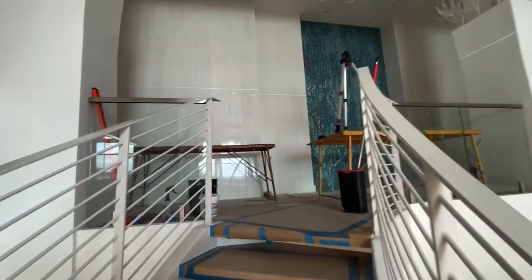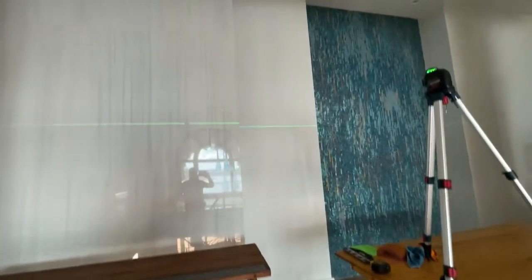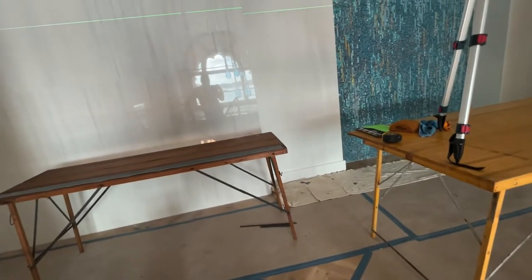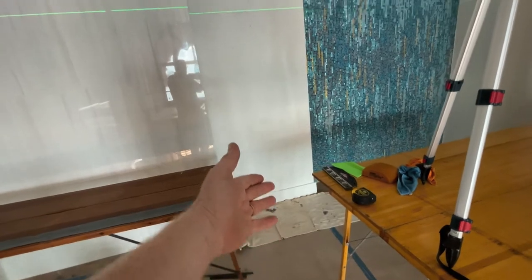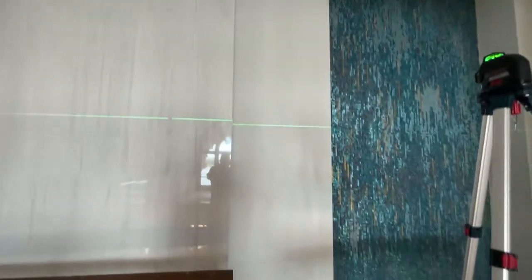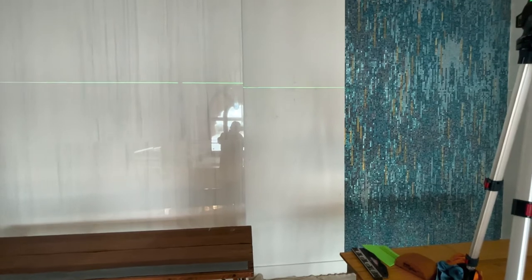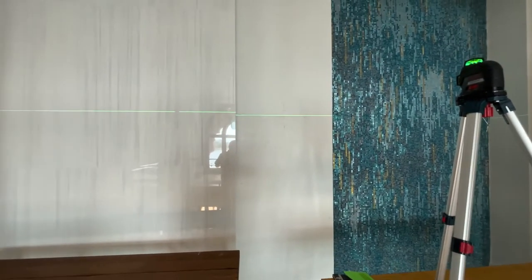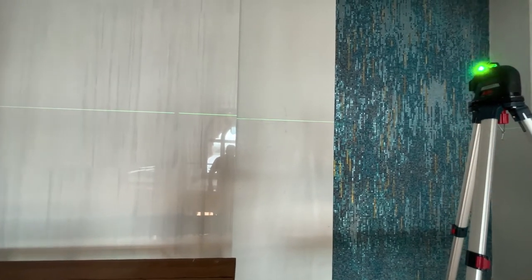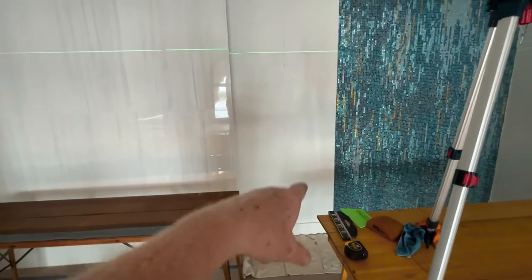And so my 29-inch tiles fell short by about 2 inches. After adjusting the wall covering, I would fall short 2 inches. So then I said, well, I can put a full panel here, bring it down 4 inches, and then I would have a little more meat at the top. And I said, no, let's go with the central point and begin from there. And because the distance between the top and the bottom of the wall divided by 29, the number of inches per tile vertically, gives me an even number of tiles from here to there,